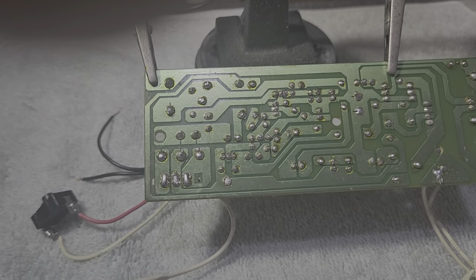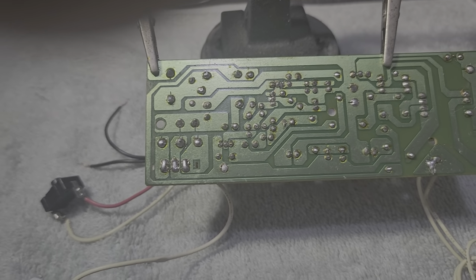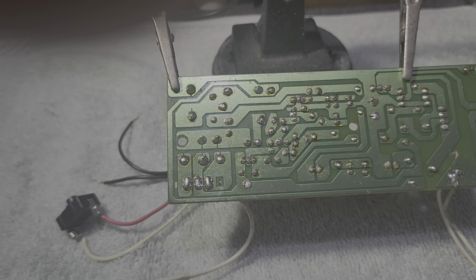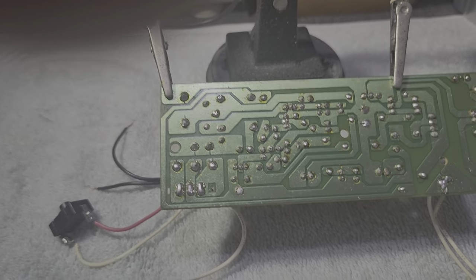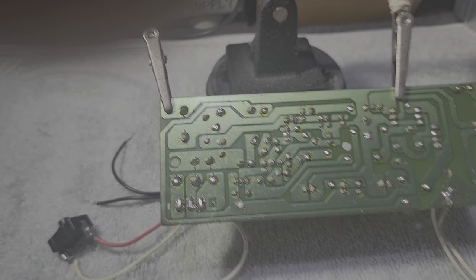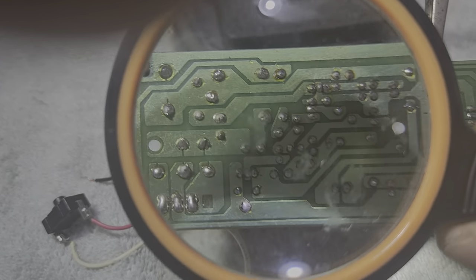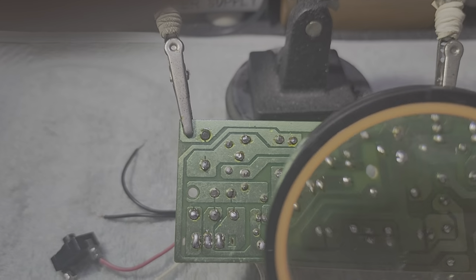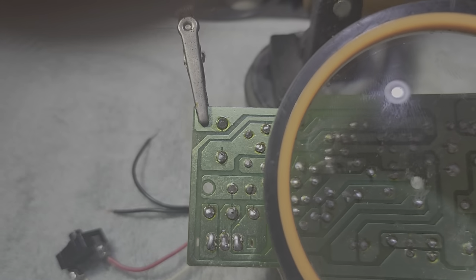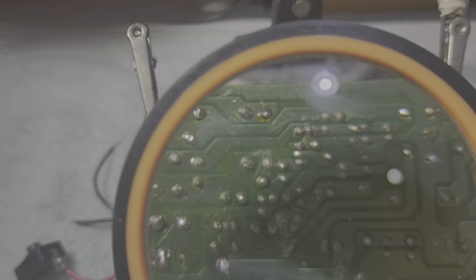Just make sure that the terminals are not connected with each other because you are doing a bad thing on the terminal. You're killing some of the components just in case you didn't see that the other terminals are actually attached to each other when you did the soldering. Then try to use your, what do you call this, this is not a microscope, it's a magnifying glass. Try to see if there are some connections which you made unintentionally, okay, to avoid